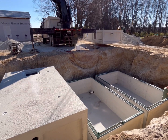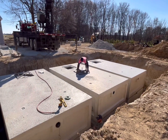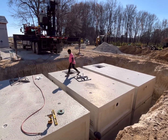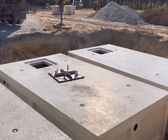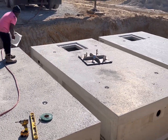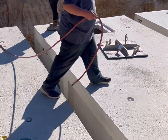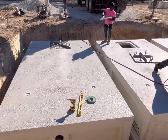If they were tied together at the top, we would need three separate pumps. Once we have the tops on the tanks, we set these aluminum plates on there with some sealant and then we pull vacuum on the tanks to ensure that they are airtight, which in turn means that they're watertight and nice and sealed.